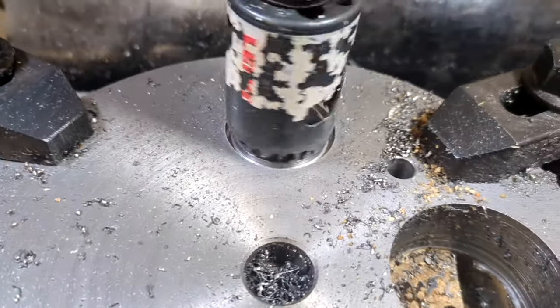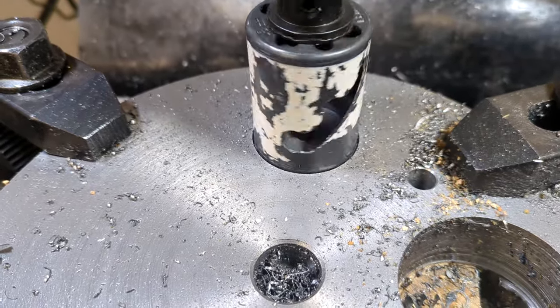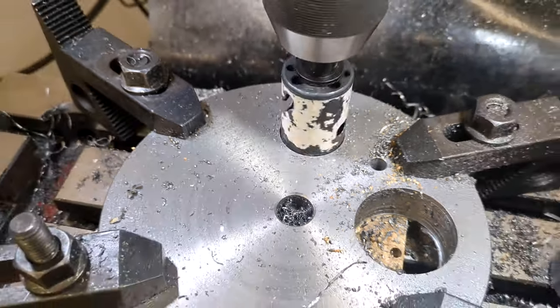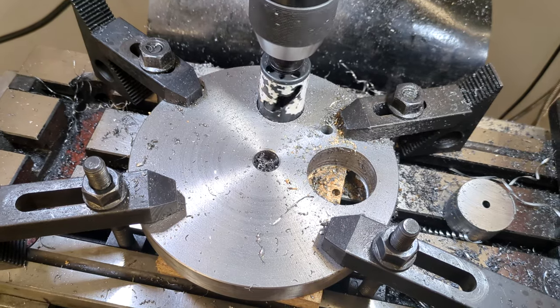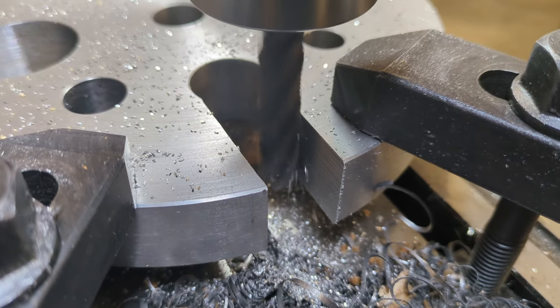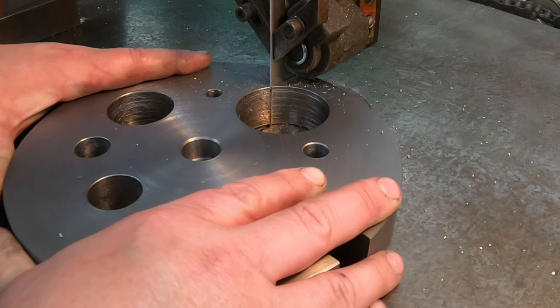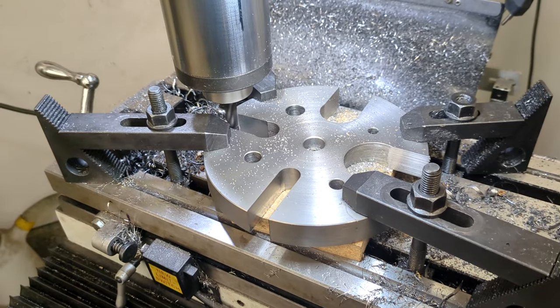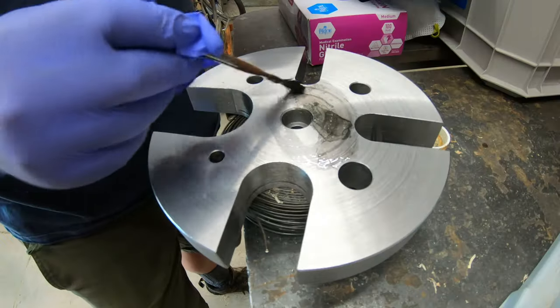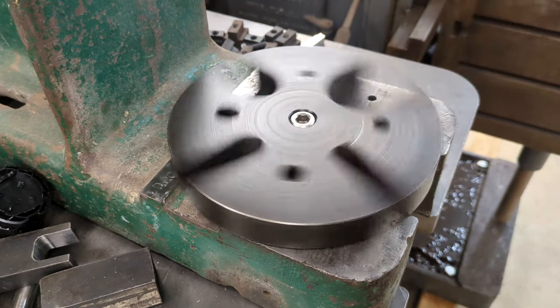The good thing about this arrangement is that if it starts to slip, it's in the direction that will tend to tighten the screw down harder. Cutting that far out means higher torque on the part from the increased lever arm, but I didn't have any problems. Then it was mill time — there wasn't anything tricky about the machining, it was just a lot of material to remove. The first step was to use drills and hole saws as much as possible, since twist drills are one of the fastest ways to remove material. Once the holes were drilled, I cut the slot to the smallest one before removing it from the mill table, so I'd have a convenient straight axis-aligned edge against which to indicate, letting me mount it back on the mill after the bandsaw work in exactly the same orientation. Cutting out the bulk of the slot material on the bandsaw went well. With that done, I milled away the last of the material on the slots. A quick application of bluing so it won't rust too unpleasantly, and the new arbor press was properly integrated into its new home. And the plate spins so well!